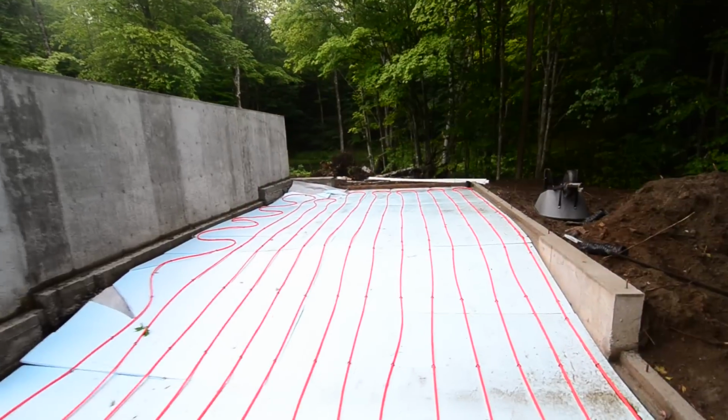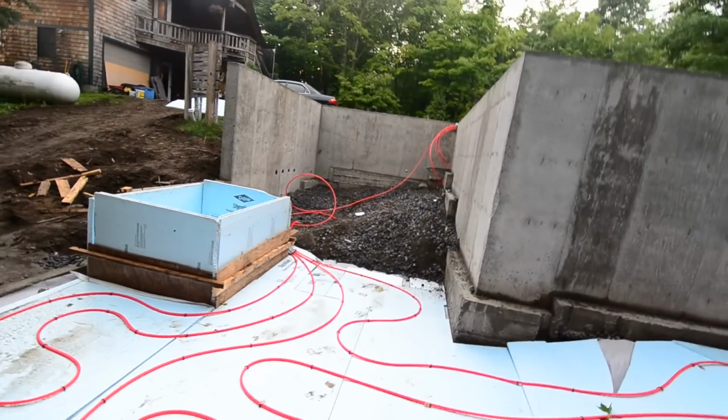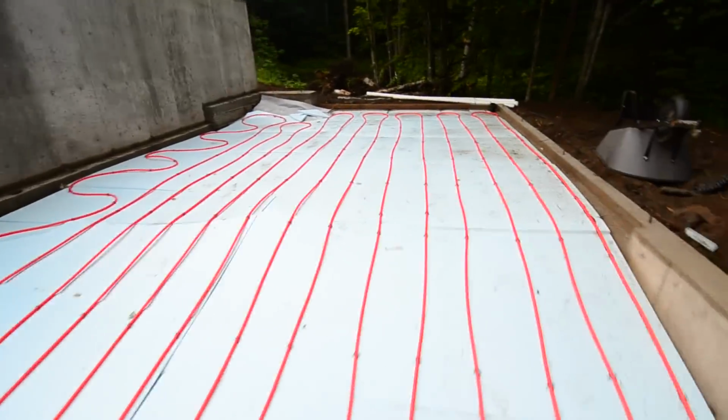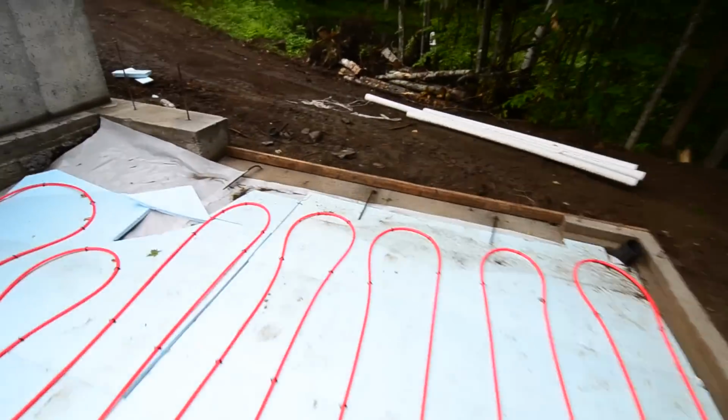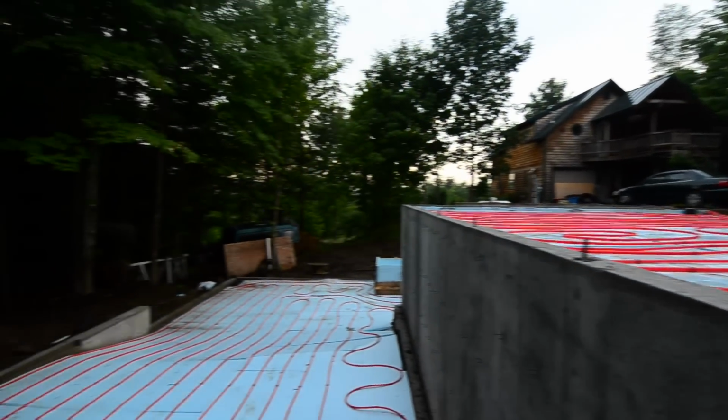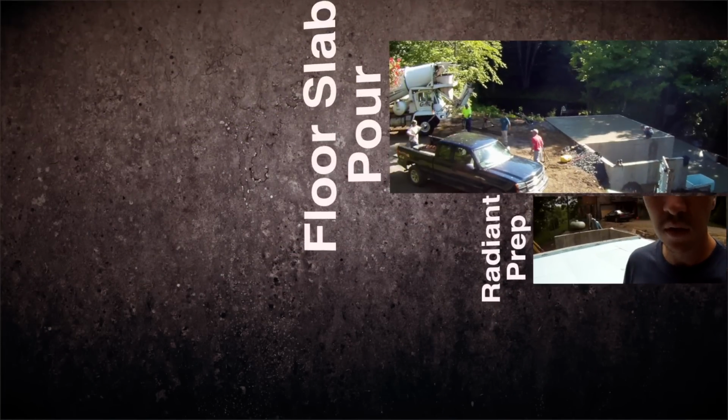I mean, there is, and you can calculate it all, but basically get the tubes in the floor. You bring them 12 inches apart, and you run hot water through them. It makes the concrete hot. I mean, it's a different story if you're building a house and you want to make sure that that floor is perfectly comfortable. But for a garage, close enough.